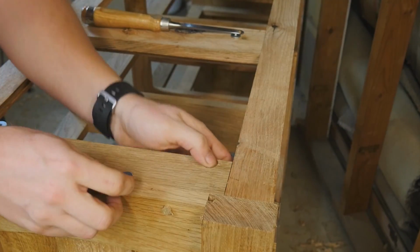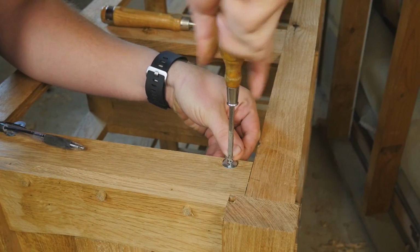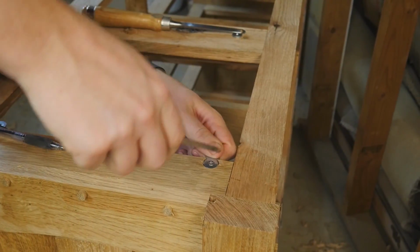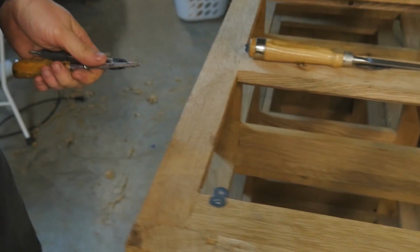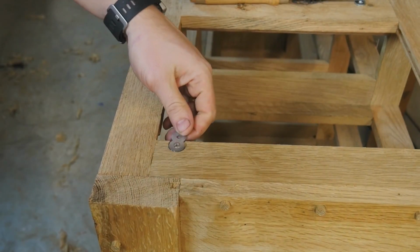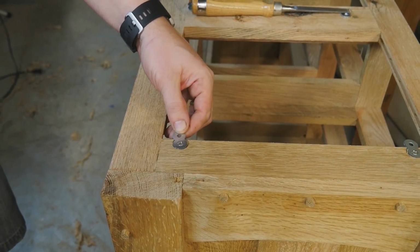But yeah, it goes in, and then you can put a screw down in. It's a very, very simple system. These are actually very heavy duty. They're not the lighter weight ones. And if you put them on the members that go front to back, then you have the ability to wiggle them forward and backward so that when the wood expands and contracts, there is movement front to back. And so that's their purpose.